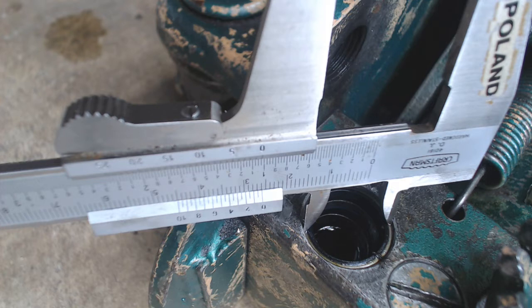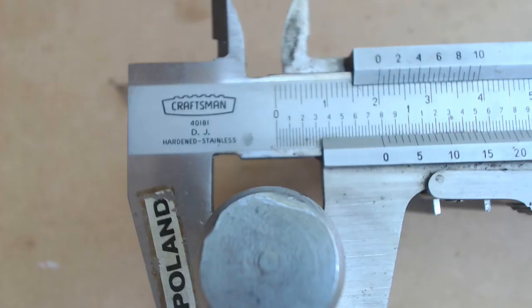Remember, this jack was manufactured in China, so all your dimensions are going to be metric. Now it's time to measure the diameter of the actuator. You want to check over this actuator real good. Make sure there are no deep scratches or gouges in it, and make sure it is completely and positively round all the way up and down. It should be pretty shiny wherever it contacts the o-rings. If you see any places it looked like it wasn't making good contact with the o-rings, it might be time for a new jack.